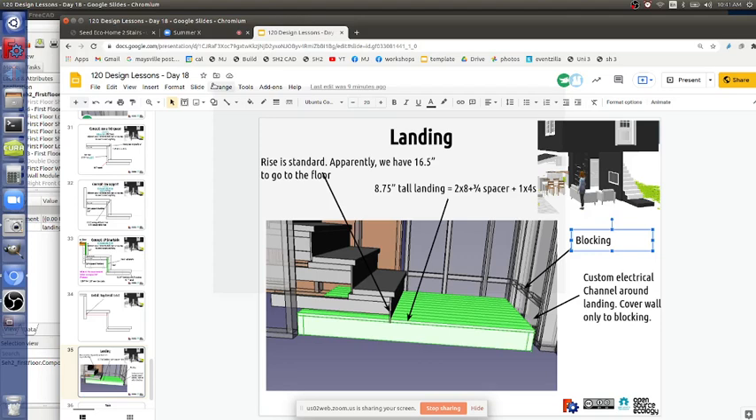You may not want to put it in right now. You may want to build it and put it aside - not put it in use. If people don't mind that big step we'd have to make a temporary step; that would be the safest approach. Just build it, put it aside, and bring it in once the house is finished. At that point you could even stain it and varnish it offsite, just bring it in ready to pop in. That also makes it easier to paint those walls. Keep it modular - all the electrical is running on top of it, it's just this module that slides in.